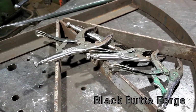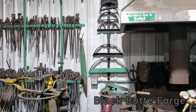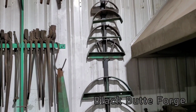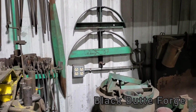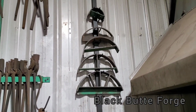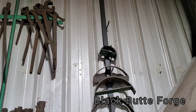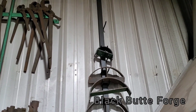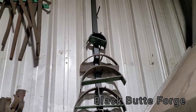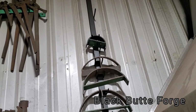And what I'm going to do real quick while we're letting some steel get hot in the forge is I want to show you how these go, okay? So on the wall, as you can see, I've got a series of them. Some are missing because some are in other places right now, just floating around. But how these are made is quite simple. You start with, say, a small piece of pipe, or say a 5-inch threaded coupler or something, you know, for some conduit, and you wrap a piece of 1/4 by 2 around it cold, and it'll spring open, okay? You weld a brace across it.